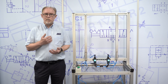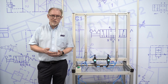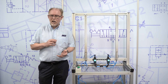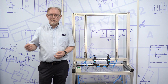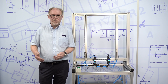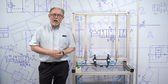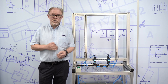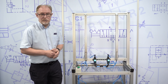We're looking for machines that have potentially high cycle rates because those are the best ones to give us the most energy saving on compressed air. If you've got a cylinder that's 160 bore, 500 stroke and you're sending it out two or three times an hour, we haven't got the volume of air that we need to actually save. So anything like hyper-packaging machines — that sort of thing — is what we tend to look at, and we do have a number of these units in some of our larger blue chip companies throughout the country.